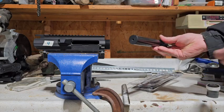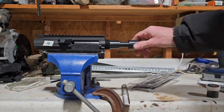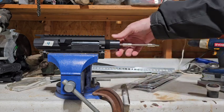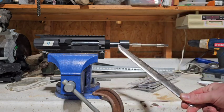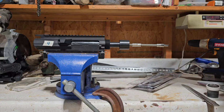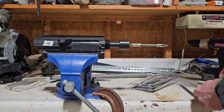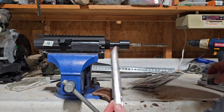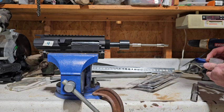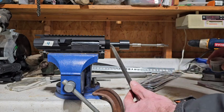This is our receiver lapping tool. It fits nicely into the upper receiver — you'll see how it comes into contact on that face and the mating surface of the receiver. In this we've got some 220 grit lapping compound. We're only going to apply the lapping compound to this surface. We don't want the lapping compound on the part that goes into the receiver because we're not lapping that — we don't want to mess with those dimensions. We want a nice tight fit and a nice flush fit here.